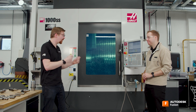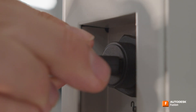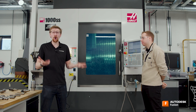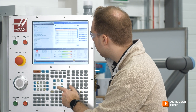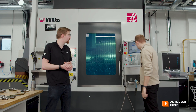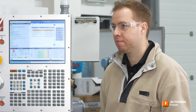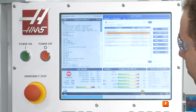It's time to send the NC code to the machine. Plug the USB stick in and transfer the file. Always copy from USB onto the machine's internal memory — someone could remove the USB during machining, which is dangerous. Use 'List Program,' find the file on the USB stick, and press F2 to copy it to internal memory. Networking the machine is even better for a smoother data transfer workflow. Once copied, select it as the active program.